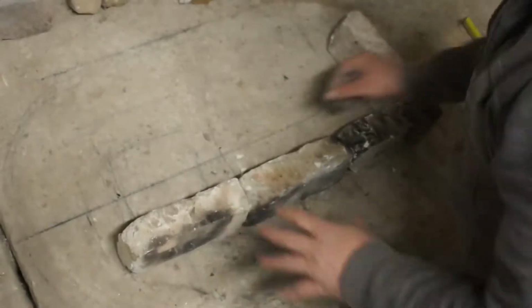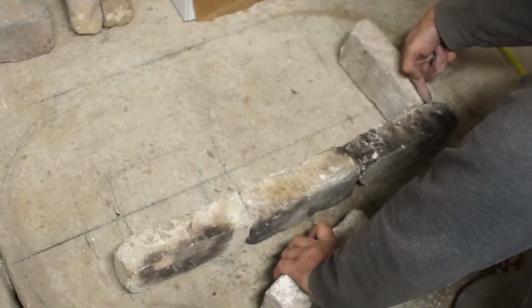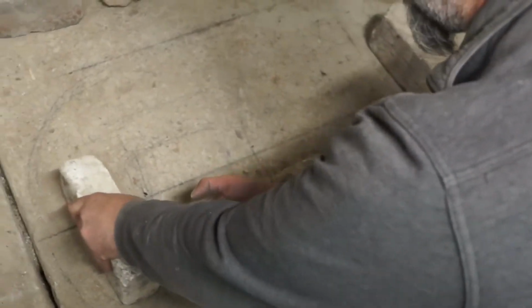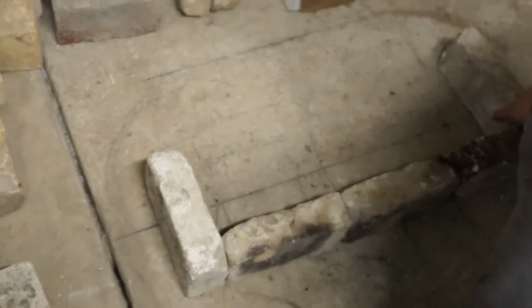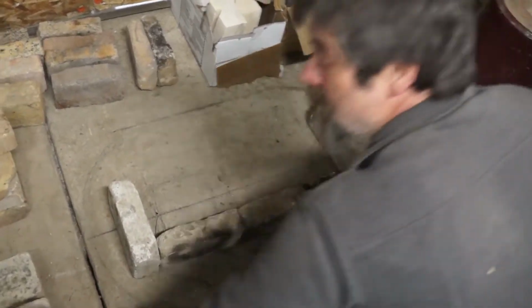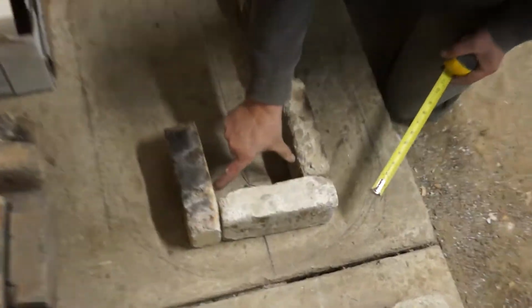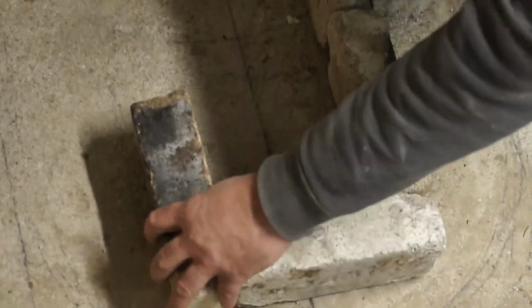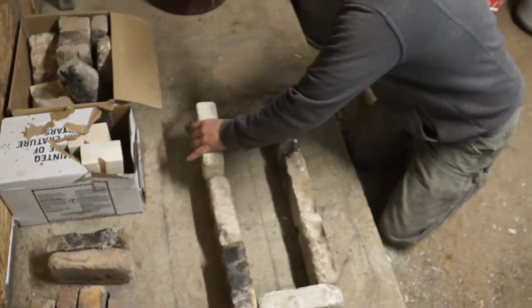We're going to redo this again when I lay it down permanently. I'll make it perfect at that time. Okay, so check it out. This brick ends at that one, and we go around and we end this brick at that one. It's sort of a swirling pattern, you know? Nice. So that when the next course goes on, it'll lap this way and come back around, so that every single course has its edges lapped over. And that's going to be 7 inches there, roughly. I'll make it 7 inches later. And we'll just follow the pattern around in a circle, a rectangle, until it touches again.